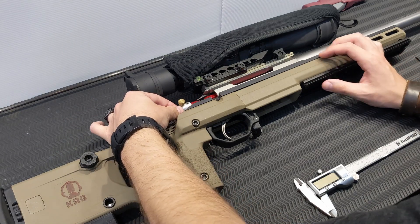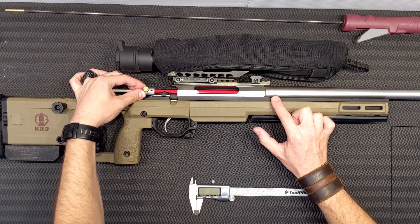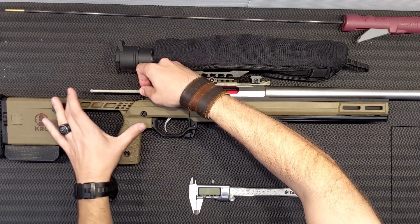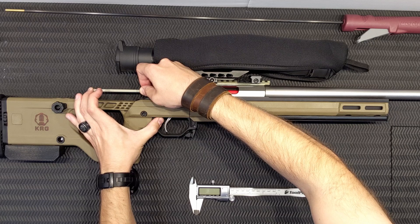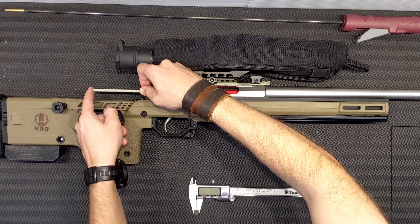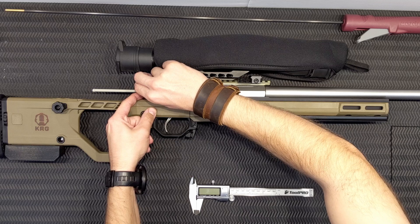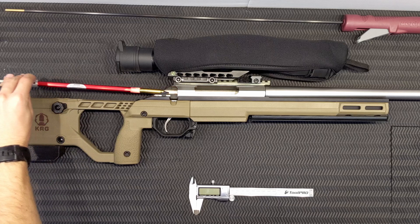You're going to push against the aluminum collar and push it as far as it will go into the chamber. Then you're going to undo your thumb stud and push the rod in, applying a little bit of pressure — you don't want to apply a lot, and you obviously don't want to break the rod. Once you've done so, lock the thumb stud up and you can now withdraw the gauge.